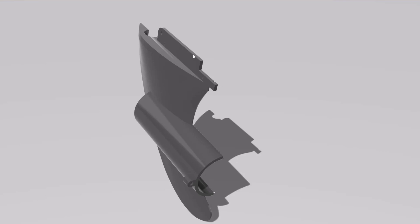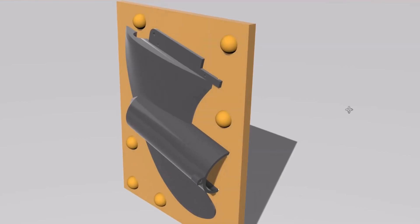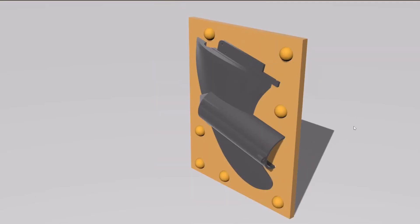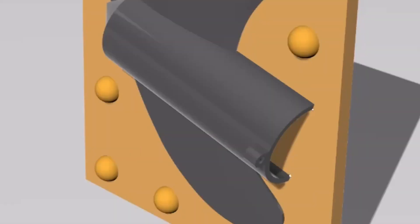This is where you want a flat parting line all the way around the part and you want it mounted to a flat surface. You could use Plexiglas, MDF, or plywood — you want it to be smooth. If you use wood, seal it well with some kind of wood sealer or wax. Also, you're going to need to key the two halves of the molds together, because you won't have a jagged cut surface in this case. I'm just going to use these little half-round spheres for that.